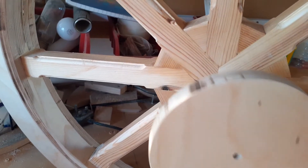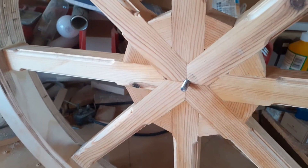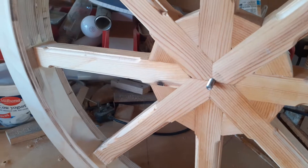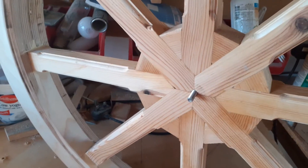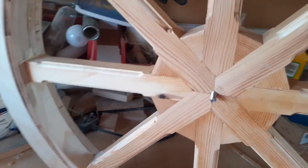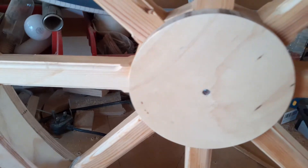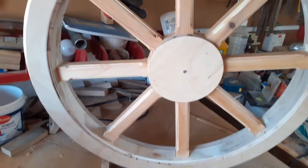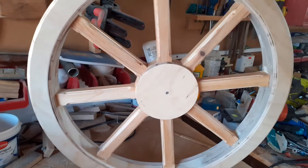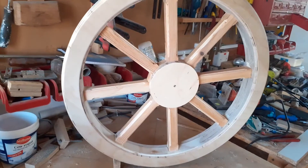On this one we have extra large bearing plates — wooden plates that cover the wheel itself and give strength to the center. The center will be bored out to take a 25 millimeter stub axle, which fits into the axle beam. With this plate in place on either side of the wheel, we mount bearing plates which carry the 25 millimeter bearing with an outside diameter of 52 millimeters.